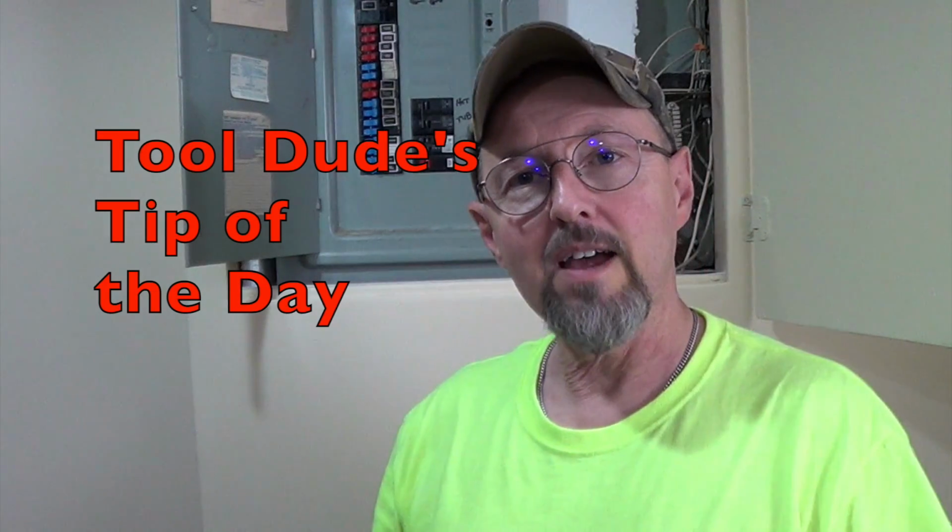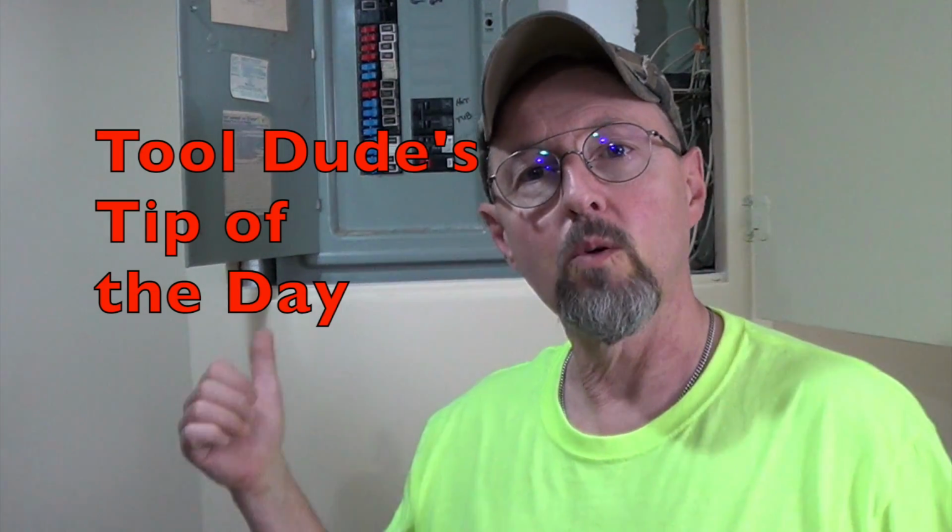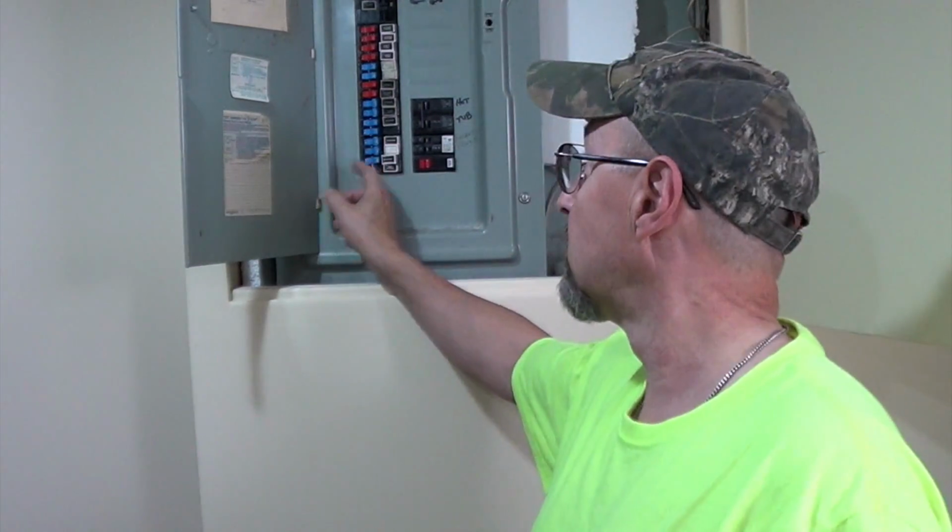The easiest thing that I have found when you're working by yourself to identify which is the correct circuit and breaker to flip is to plug a radio into that circuit, turn it up so you can hear it from the breaker panel, and then just listen as you start flipping off breakers. It's tunes, tunes, tunes, no tunes. Hey, that must be it. Okay, that's how you can tell.